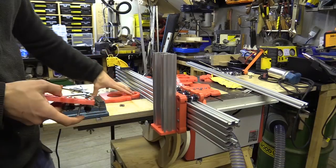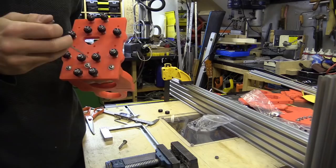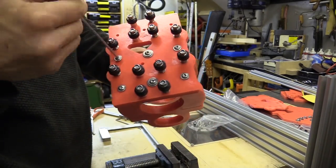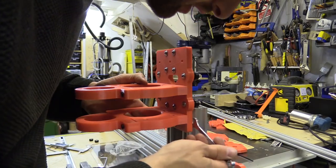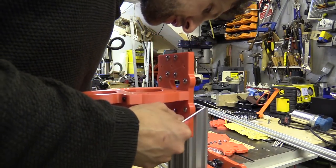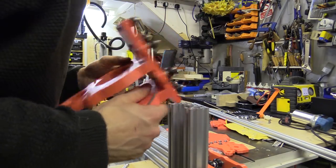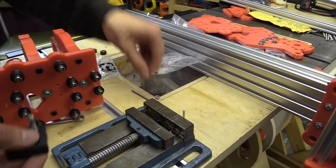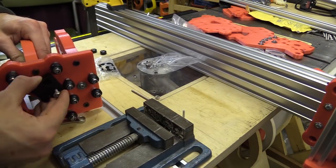So the next thing I'm going to do now is screw these sections on. These are rubbing on the bit here so I'm going to have to change them with low-profile ones. I'll just put two on for now - so that was the problem. I've got to take these two off as well, that's all four of them. I've left two as they are because that shouldn't get in the way. I also changed the centre spindle mount machine screw, which would be hidden by the anti-backlash nut block, with a 35mm low-profile one, as this was obstructing the nut block.